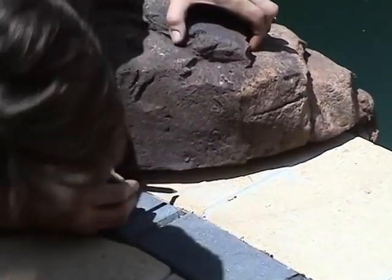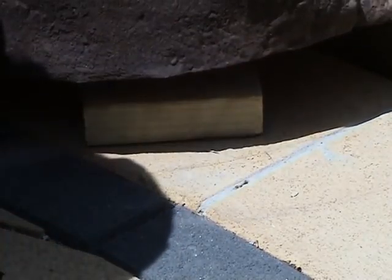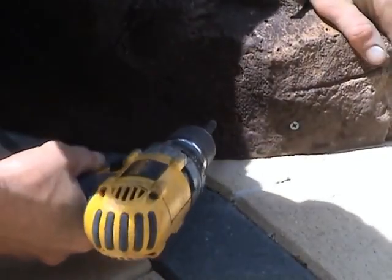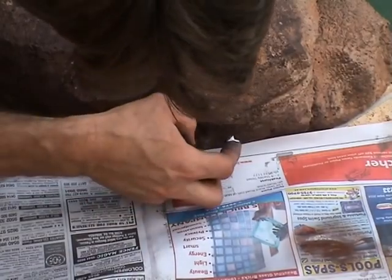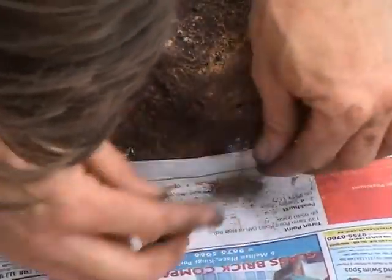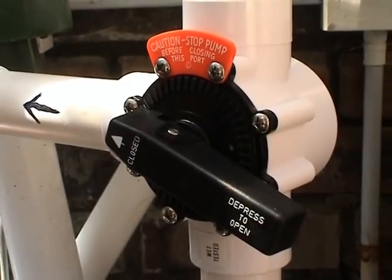Place rocks back over the blocks of wood and mark on the pool edge to help guide where to drill screws into place. Due to salt and chlorine, stainless steel screws and bolts are recommended to prevent rusting. This will also allow you to remove them if required. We suggest that you camouflage screw heads with a silicon adhesive, then simply throw onto silicon coloured sands. This can be achieved by crushing similar coloured authentic rock.